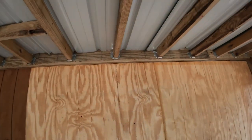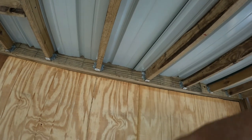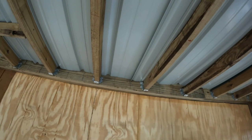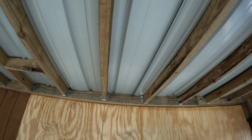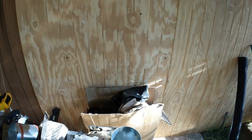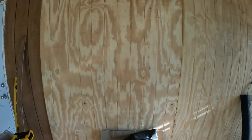I've looked at the dimensions on here, so I know it's going to be 8.13 inches — let's call it 9. So I'm going to have to put it up further this way. It'll just hang down about this low, just clear my noggin. I'll probably have furniture here anyway, so it ain't going to matter. I'm probably going to put an outlet straight down from there, which makes it very simple running the switch and the wire for the outlet.